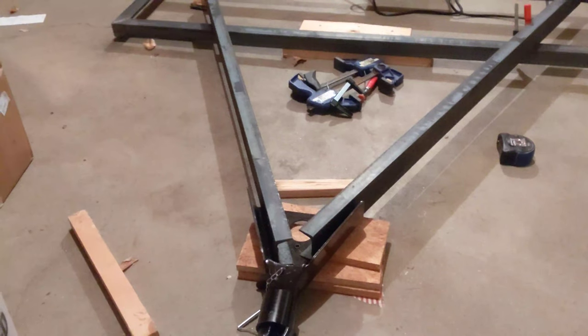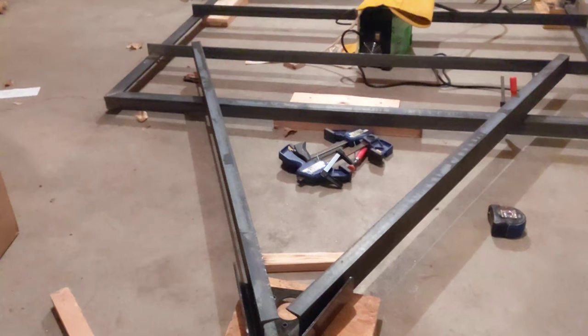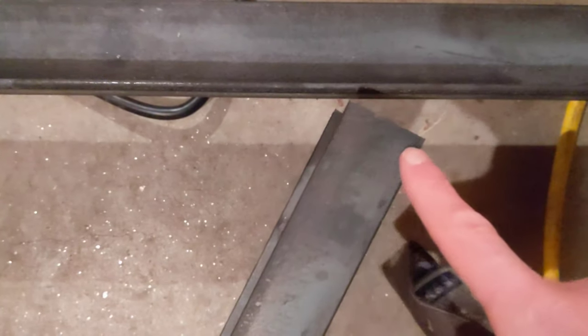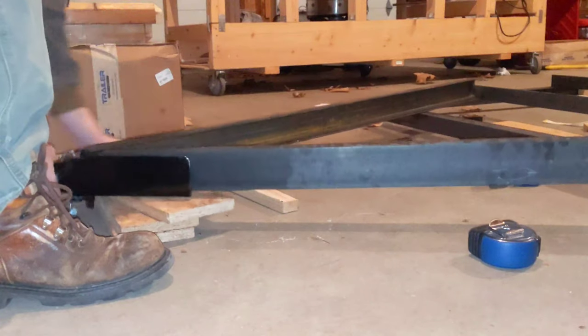So I'm going to assume that we're going to have that coupler kind of lifted up a little bit over the A-frame, because that's the only way we can get it to fit properly. The next thing is to get the A-frame clamped to the coupler and clamped to the chassis so we have an idea of what the angle is going to be, so we can then make our cuts on the far end of these beams to be flush with the chassis. Then we'll have a weld going up and down and also across the bottom.